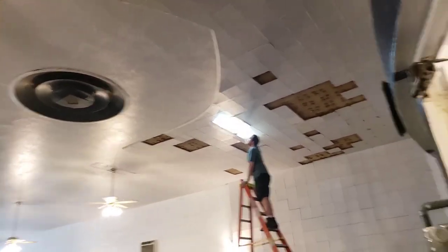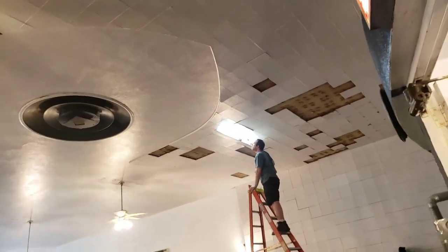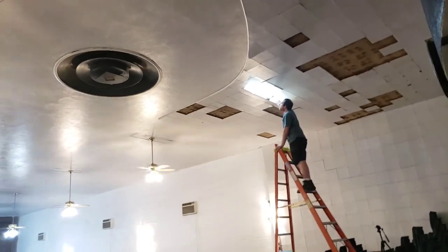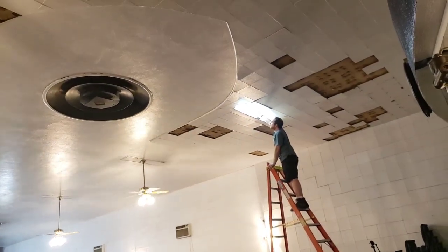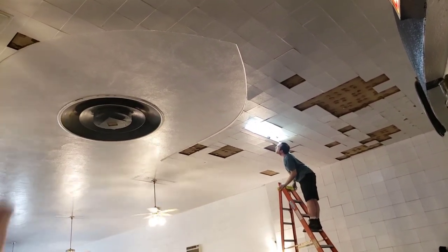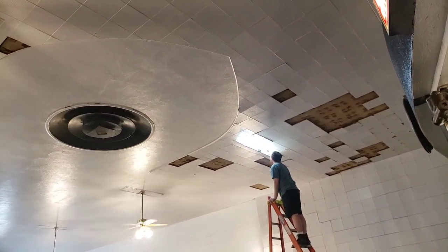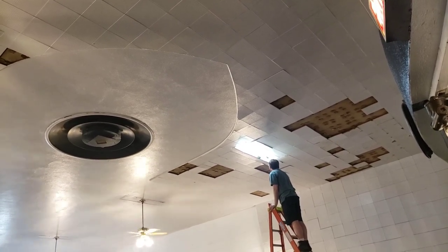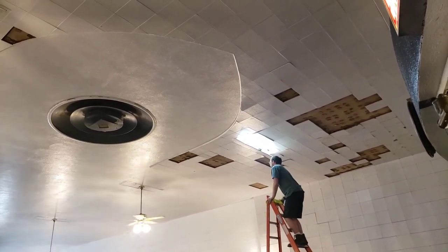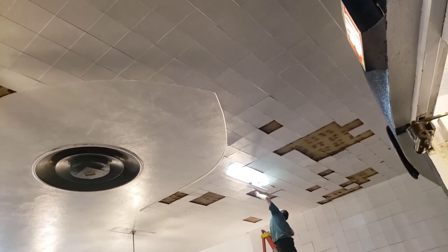Here's what I want you to do. Not right this second. This is your homework assignment. Research what would be the easiest kind of drop-in LED tubes that we could put in these, and you can have as many ballasts as your heart's desire. And we don't have to worry about replacing sockets and starters. Something we could literally just put in there without even using the sockets necessarily. Just mount them in place and wire them up. Taking the fans down would be the hardest part of that. And cutting the plastic is a little bit of a pain, but you can use the existing plastic as an outline.